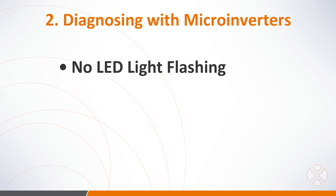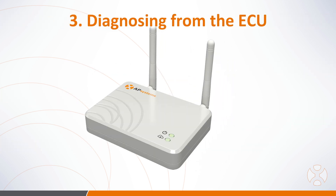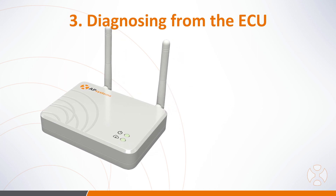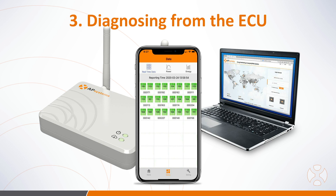If you see no light, verify proper cabling and that connectors are properly seated. If you see a blinking green light, whether slow or fast, the issue is probably with the ECU. If there's no data being displayed for one or more microinverters in the ECU app or EMA, this is likely a communication issue, not a microinverter problem. If the data display for all microinverters is erratic — where data appears sometimes and disappears at others — this is also likely a communication problem. If the data display for only one microinverter is erratic but the rest report normally, it's likely a microinverter problem.